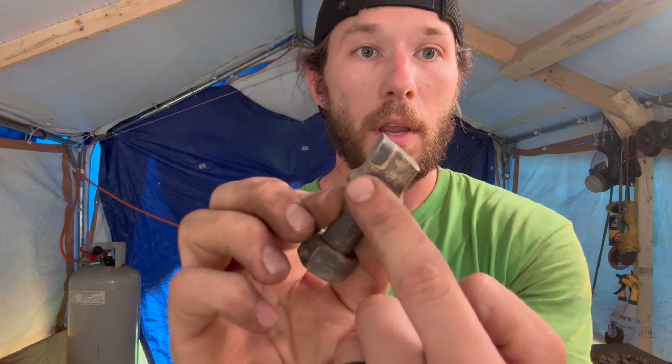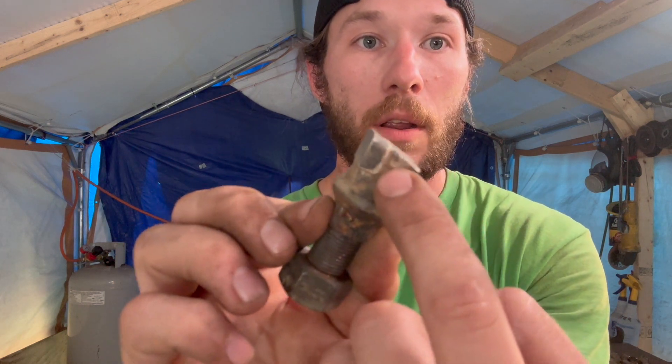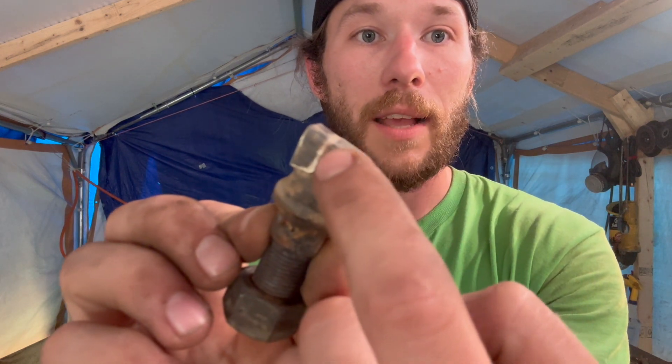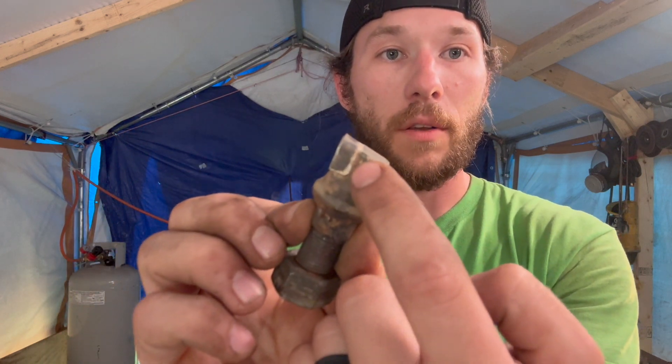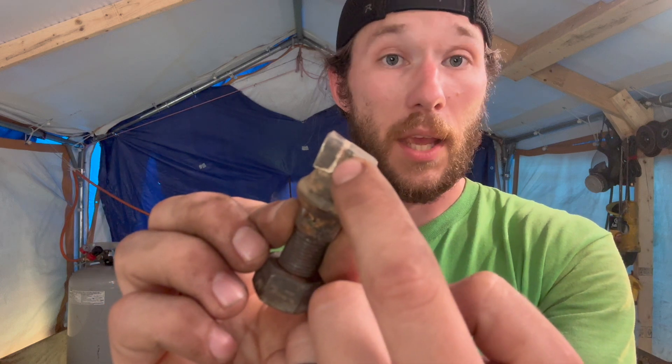I can't really add them on because when you add the carbides onto it, you want to be able to watch how the silver solder binds and how the tooth moves to make sure it's fully connected inside the gullet, which is right here — the shape of the housing right here. That silver solder we're talking about is that silver line right there.